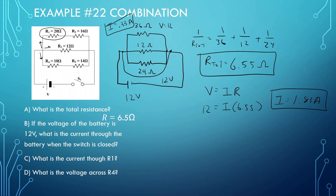What is the voltage across R4? We know throughout this whole branch it's going to be 12 volts. However, these resistors are in series, so the voltage changes in each one add up to 12, but we don't know how much is in which one. So let's first find the current: total voltage is 12 over resistance 24, so the current is 0.5 amps, because 0.5 times 24 equals 12 volts. Now, 0.5 times 10 equals 5 volts across R1, so the voltage change across R4 is 7 volts, because the total must equal 12. Thanks for watching.